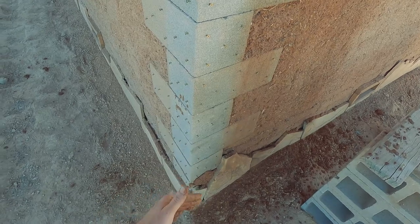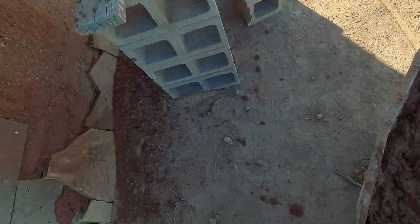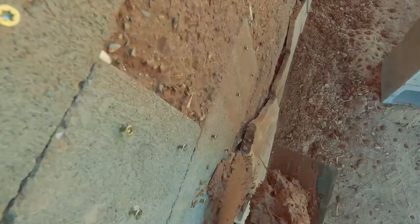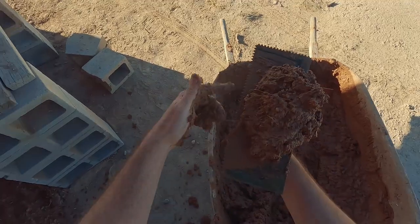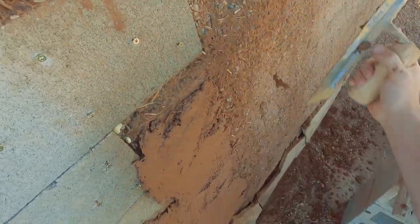I haven't talked about the flagstones yet — I put the flagstones down and attached them to the concrete stem wall so the next plasters have something to sit on rather than resting right on the ground where moisture could soak in and damage the plaster. I'm going to spit a little more on there and then take our trowel and squish it on up — getting it grabbing onto the screws. We want big, long scoops. It also helps to get some of it over onto the earth wall. I'm using the scratch edge of the trowel to round it up and get those ridges.